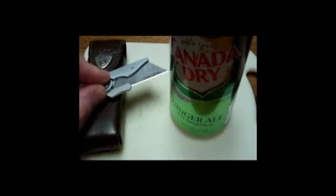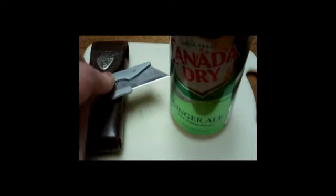The first step is to cut your cans down to size. To do this, I rest a utility blade on top of something. This stove I plan to make about 3/4 inch thick, and I just happen to have a knife sheath around that was exactly that height. And then you take the can and you push it up against your blade and just start spinning it around a few times. What you want to do here is not necessarily cut the can, but kind of score it.